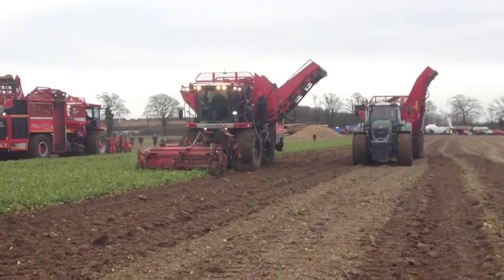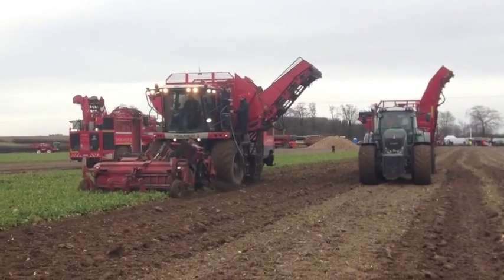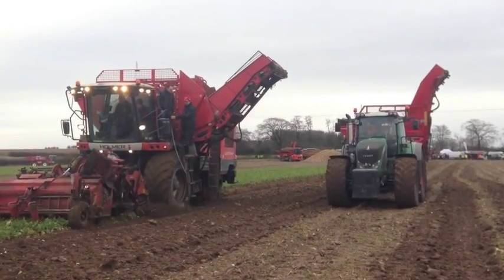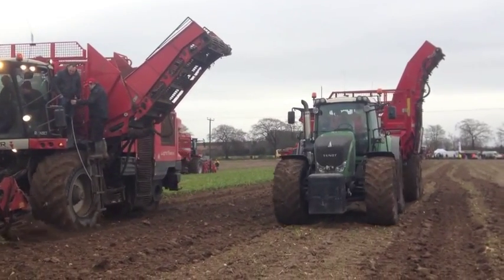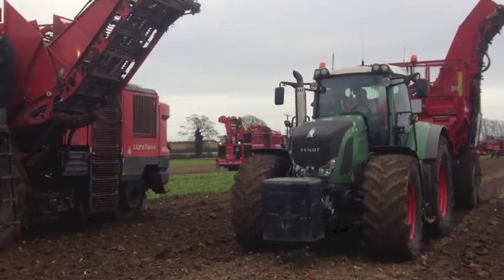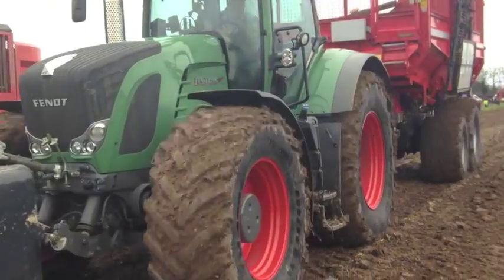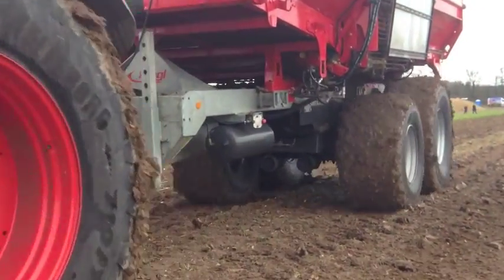The Transcart has a capacity of 20 tonnes and itself weighs 10 tonnes. This weight is supported by front tyres that are R710-50 with a 26-inch diameter, and a rear set of R750-60 with a 30-inch diameter. The size of the front tyre axles is restricted by the position of the unloading elevator, but Holmer saw no reason why not to go large on the rear axle.